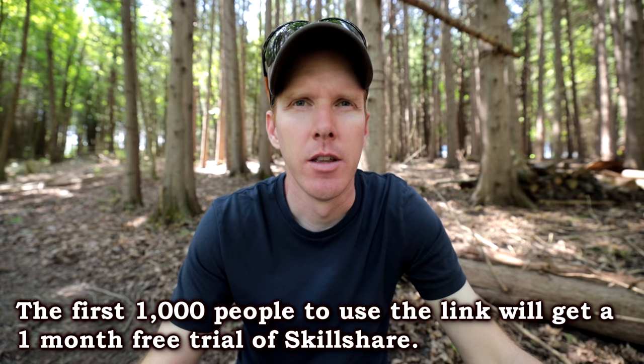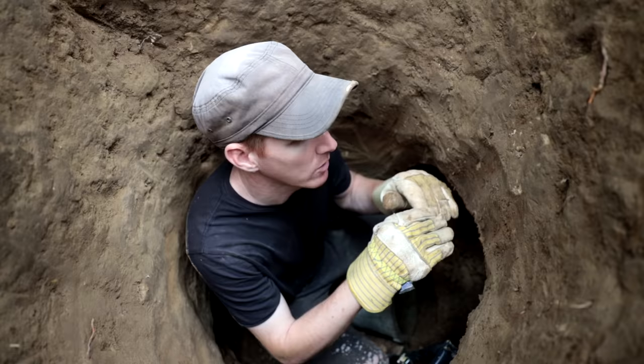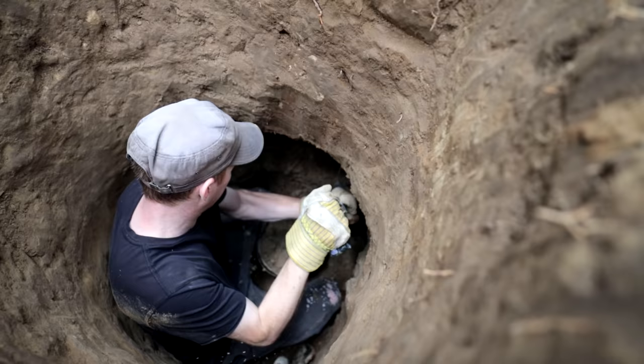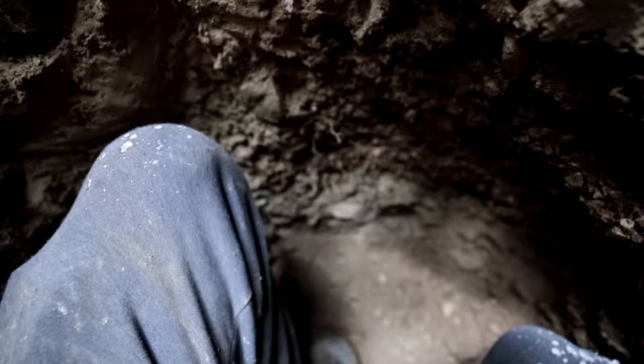We're at the point now where we're going horizontal. I don't want to put wooden supports up quite yet because they'll be in the way, so to stay safe I'm not going to put my head under the unsupported face. I'll dig as far as I can and then put wood up so I'm never working under unsupported ground. There's about two feet of clay above me which is really stable as long as it's not wet — and today it's not wet. Let's keep digging. This here is the face of the tunnel.